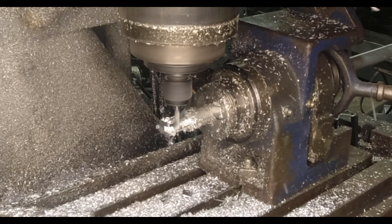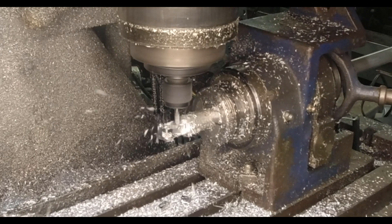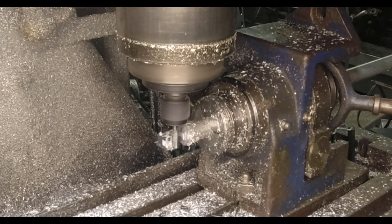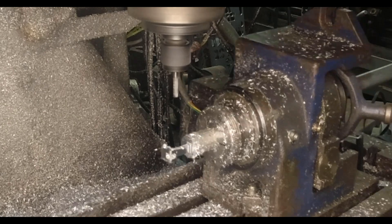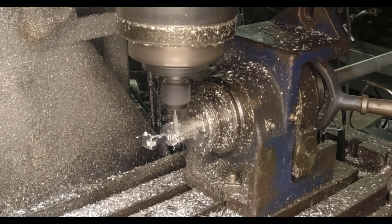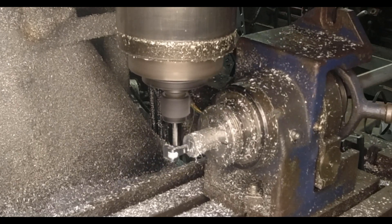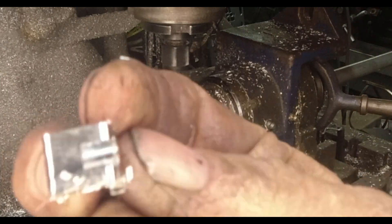These were brand new — they weren't even two hours old — and they just broke. So on Friday I actually spent the time, programmed it up, and made distals on the fourth axis on the milling machine. Really three of the four are great. The pinky ends up hanging a little bit, so I need to hit it with a file and make it all better.